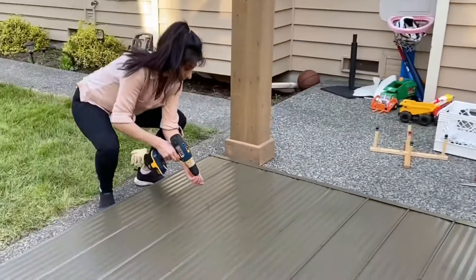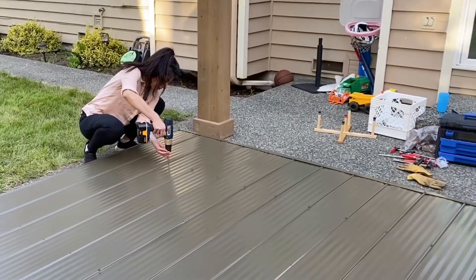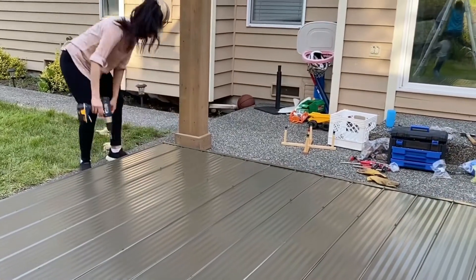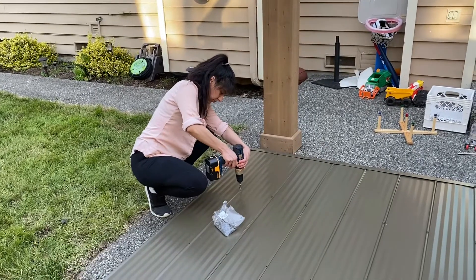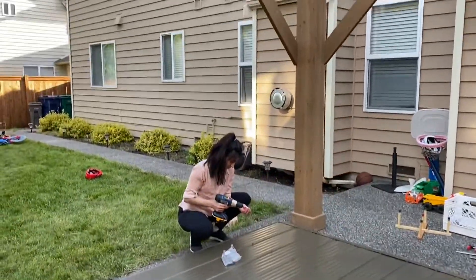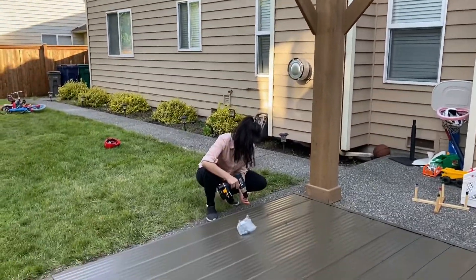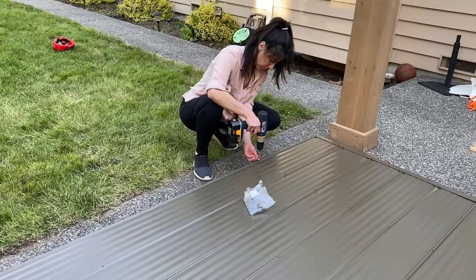Steps 8 and 9 is installing the roof panel frame to the aluminum roof. The instructions manual recommends hand-tightening the roofing screws so that they sit snug and tight to the roofing material. We didn't hand-tighten the screws, and this might cause the pavilion to creak just a bit with heavy winds. So don't skip hand-tightening those screws to the roofing material, because you won't be able to tighten them afterwards.